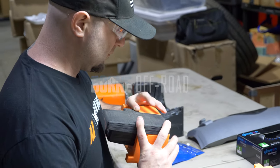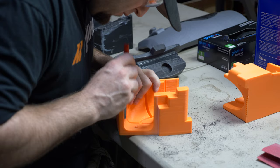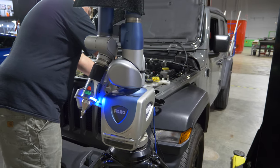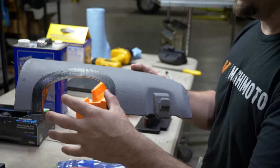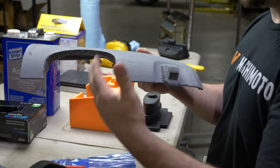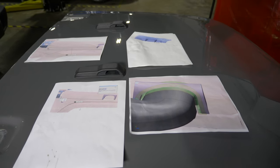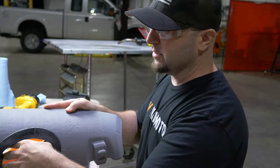We have three pieces of a 3D printed tool and what we're trying to do is make a rubber piece — once these are all fitted I can do a hand injection mold of rubber. We 3D printed the hood, so this is a one-to-one Jeep hood for the new JL, but our snorkel kit has to come through the hood once the hood is shut. We made this bezel piece that, after you trim the hood on the actual Jeep, gets stuck on here — it wraps around, seals the area, and also seals the snorkel from the hood to the body once the hood is shut.